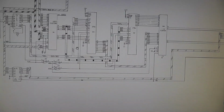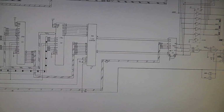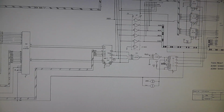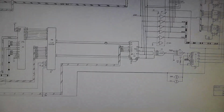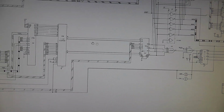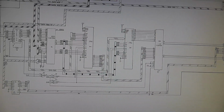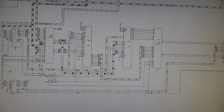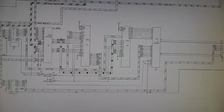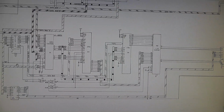And I was reading on Klov, I just googled sprite issues on Mappy, and J-Rock had a comment on a thread where he said check 5K, and that kind of gave me a direction. So I can think of this area at the bottom here, which is part of data bus 3. Data bus 3 comes in here, and yeah, and data bus 2 actually.